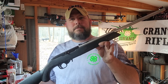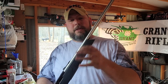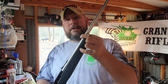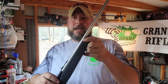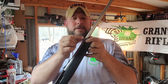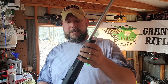Along with those checks, we'll go into some slight, inexpensive modifications to benefit the shooter with this rifle. One thing is to remove the barrel band. You can see I've already removed this one and modified the stock slightly. The barrel band usually either pinches on the barrel, pulls it down, or is tight on the barrel. Some people who want to keep the barrel band for a sling sand down the inside so it doesn't contact the barrel. We've noticed that if it doesn't touch the barrel, it helps accuracy. Along with the torques, everything works in conjunction together.